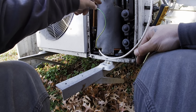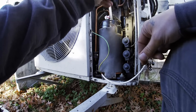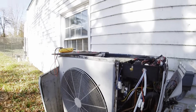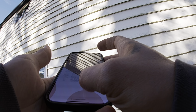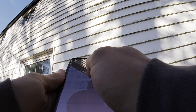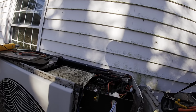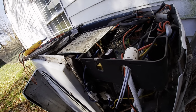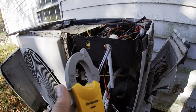I mean, I know our compressor doesn't appear to be in the best shape. So, just waiting for it to ramp back up. But according to this, let me see. Let me find that again. UVW connect to compressor voltage among phases 0 to 200 volts AC. So I should be able to check it on that once it comes on. First, let's find spot.